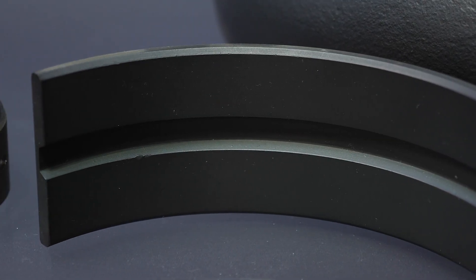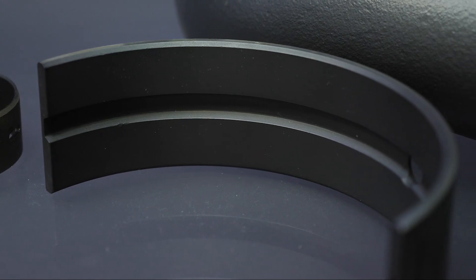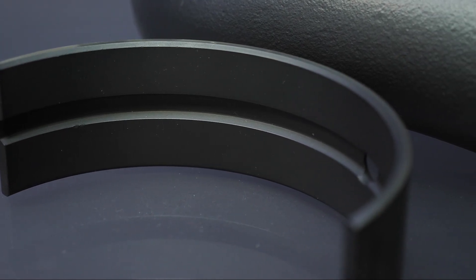Well you're 100% correct — there should never be metal-to-metal contact on a bearing. As long as there's an oil film between a bearing and a crank, I don't have any particular preference for a bearing brand — they're all good bearings and will hold up to the manufacturer's life. But what the real world sees is that there is metal-to-metal contact. If there were no metal-to-metal contact you'd never lose a bearing — but we know that happens.